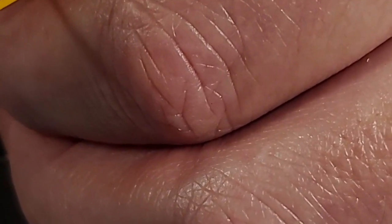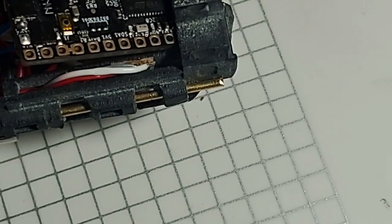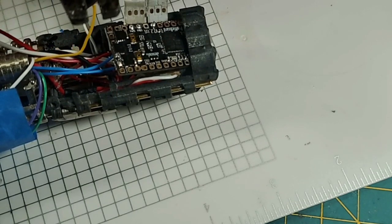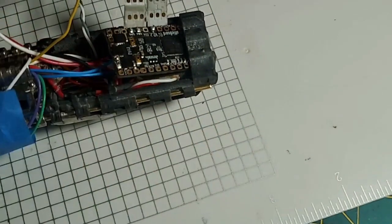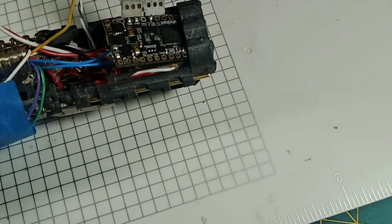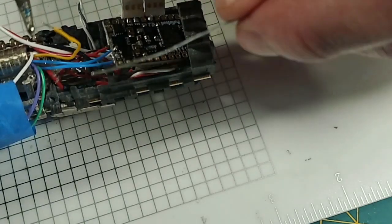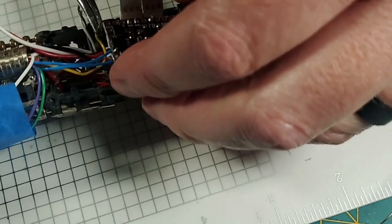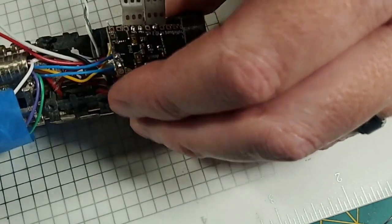I'm going to leave just enough slack so we can pull this board out if needed. The bad part about this chassis, and I'll show you when we're done installing it, is if you had to replace the speaker, it's kind of a nightmare on this Saber. So I'll typically run the volume on this Saber a lot lower than I would on an install where the speaker is just in the back of the chassis, because a speaker in the back of the chassis is like a 5-minute fix, whereas replacing a speaker in this Saber is almost like a whole reinstall, because you have to take all the wires out of the soundboard, take them out of the routing, place in the chamber. You got to take the entire chassis apart again, and it's kind of a nightmare.